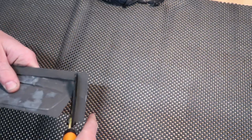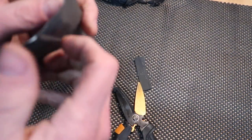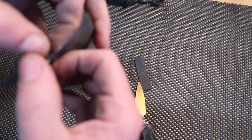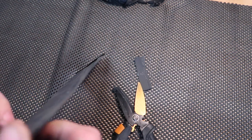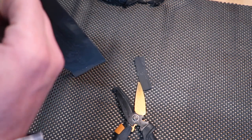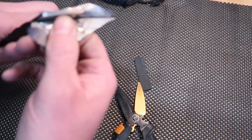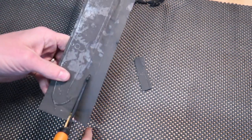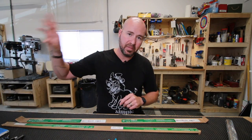I don't know why that didn't happen when I use paper. I get the opposite. I'm not sure what I was doing, but like I said, I've done about 20 blades with paper and over half of them puffed up. And so I'm just like, I can't figure this stuff out. I'm leaving it alone. So I don't do paper in mine. But that is one of the first big differences between the carbon steels and the stainless steels, is that decarburization happens and we need to mitigate it somehow.